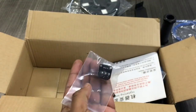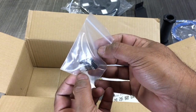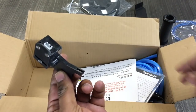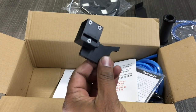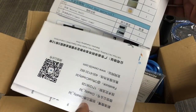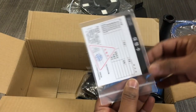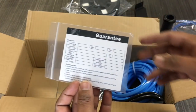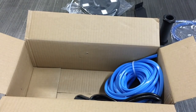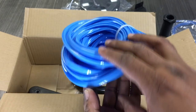A lot of printers don't include spare parts and it's really hard to find these little tiny parts. This one right here is the sensor that stops your Z, Y, or X axis — it's like a limiter. And this is the new upgraded filament sensor shutoff — something new that people have been talking about and that Creality is advertising for the CR10S. Next, we have the manual, though I'd recommend just tossing it — there's some useful information on the USB drive. There's also your warranty card and the brackets for the left and right side, which lock the top frame to the bottom frame.